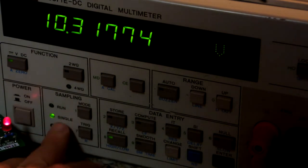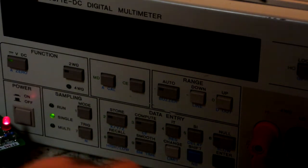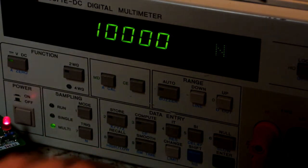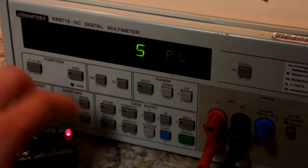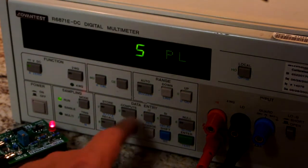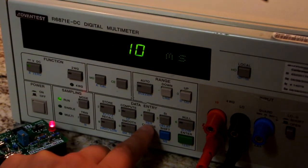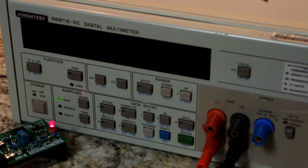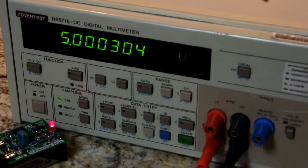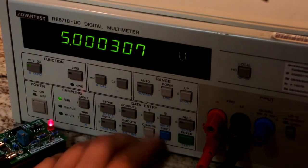I'm not sure exactly what the multi mode is about, but I think it's related to the N setting where you can set a number of values. The numbers on the buttons go one through nine with zero up at the top, which is a bit weird. In this entry mode you need to press change to cycle through available options. I'll set this to 100 power line cycles, which is the longest integration time — as you can see it takes quite a while to take a measurement; after auto-zeroing, you get a reading about every two to three seconds. One thing that's annoying is that if you try to change any setting or pull up options while it's in the middle of a measurement, there's usually a delay of a second or two as it seems to wait until the measurement is complete.